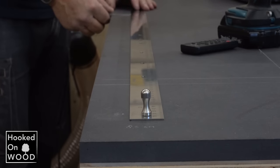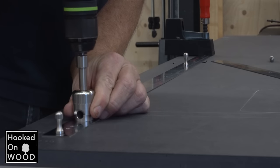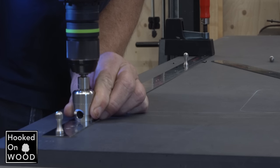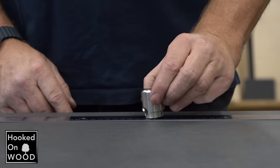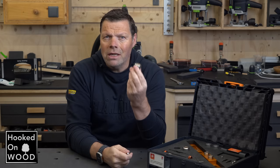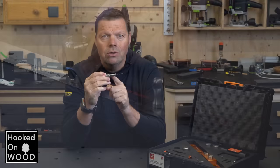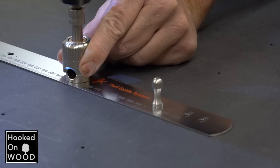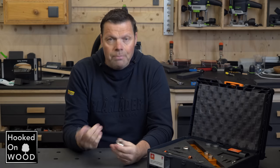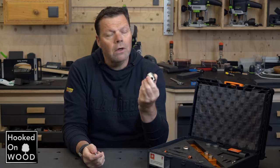The two rulers you need to make a grid layout are decent and the holes are perfectly accurate. First we make some small holes that we will later enlarge to 20 millimeters. To ensure we drill these holes perfectly straight, there is a bushing to guide the drill bit. The bushing has a small piece at the underside that fits precisely in the hole, so there is no play. This is a very nice and solid piece — it does not guide the drill bit itself, but guides this piece of the drill bit, and this fits exactly without any play. Not only does this ensure a perfectly straight hole, but it will last longer because the drill bit does not contact the bushing.